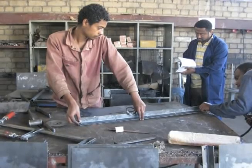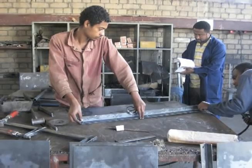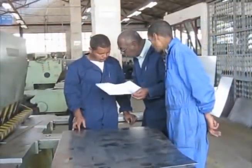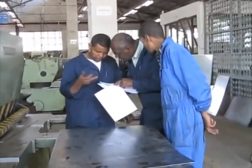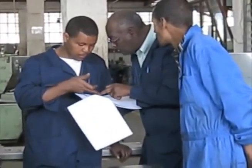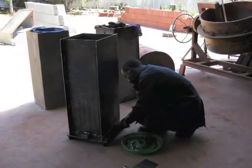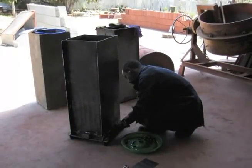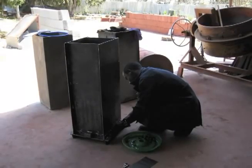Before we get going, there are a few tips. The first time you have a mold made, book one week of time to work directly with the welder, or check in periodically to make sure they understand the instructions. Don't expect to simply drop off the plans and come back to pick up a finished mold. Explain to your welder what the mold is for and what the most critical parts are. If the welder doesn't know what the part does, they won't understand what's necessary to make it work.